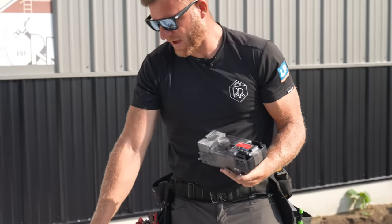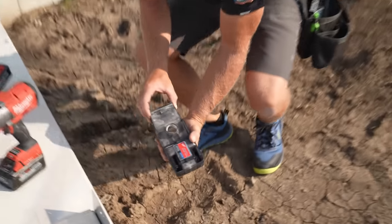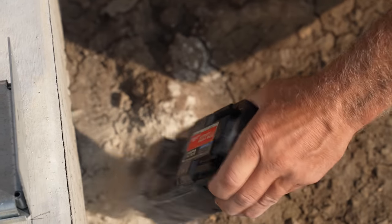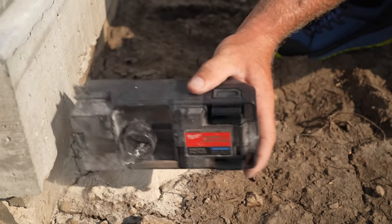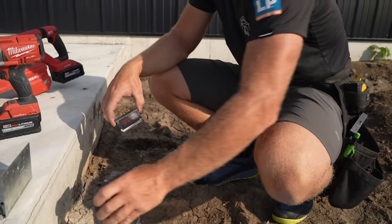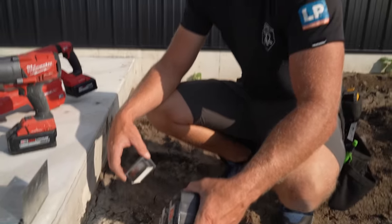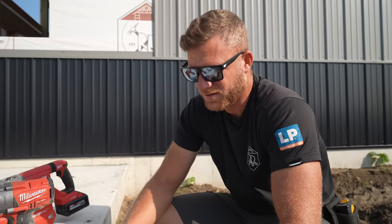This SDS drill is pretty impressive now that I've got the vacuum working. Look at how much concrete dust. This is kind of a unique design — this thing is packed full. This is just from doing six brackets — saved all that dust from blowing around in your face. Most importantly, whenever you vacuum the holes, the fasteners go in much better. You might be like, 'wow, you're just dumping it out right there' — it's fine. You just don't want to be breathing it while you're working, so I'm just getting rid of it here. This will all get back-graded and go back to nature, I guess.